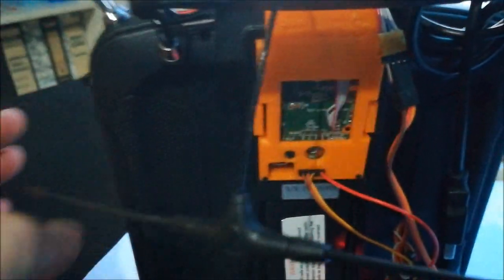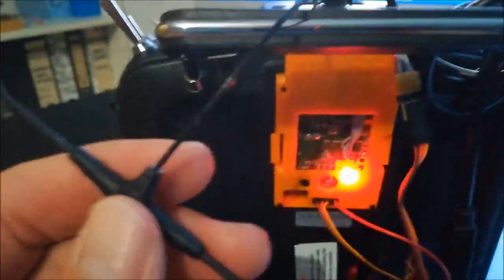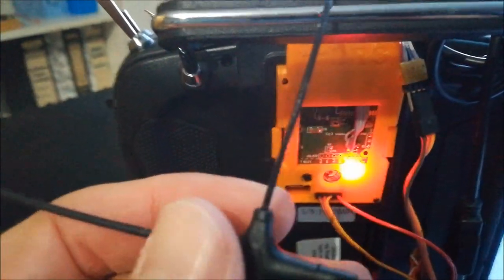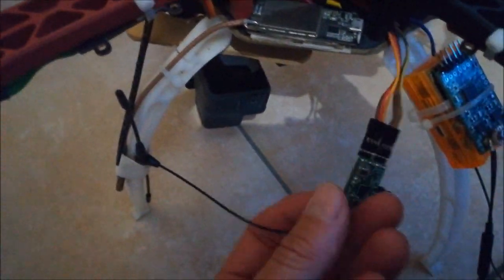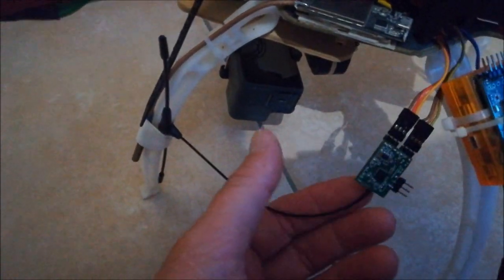Here I have my MLS setup with my usual typical design for a transmitter module. What's somewhat novel about it is that it uses the E22 module — it works on 868 MHz. On the copter I have a similar installation: this is the receiver, that's the antenna, it's just floating here. The module is relatively small, so size-wise that's okay.